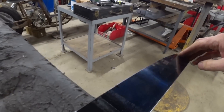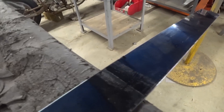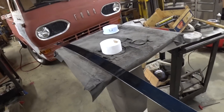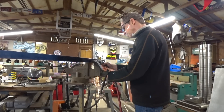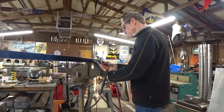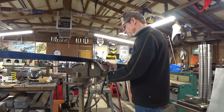One of the other things I want to do is change out the trim spring. I've got a coiled spring right now, so I bought some spring steel from McMaster and guesstimated what thickness and width to use. It's really difficult to cut and even more difficult to drill through. Here I'm using a cutoff wheel to cut off a section about 10 inches long, and later I'll drill holes so I can mount it in place of the current coiled spring.